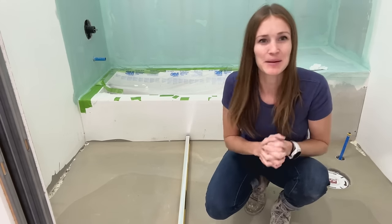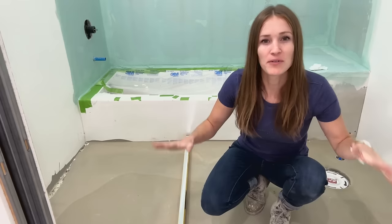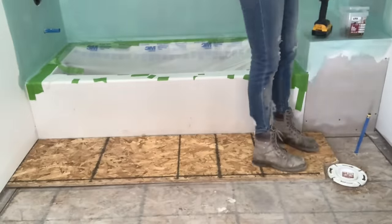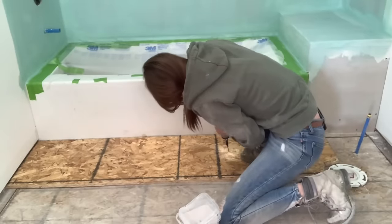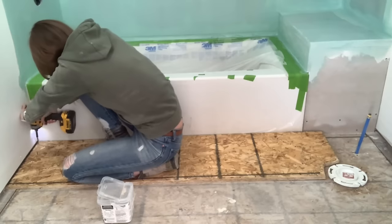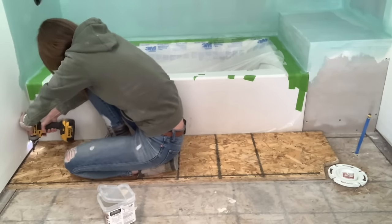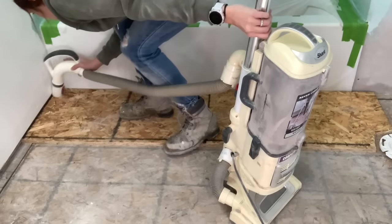Come with me and I'm going to show you how to smooth the floor before you lay your tile, LVP, or whatever you're going to put on top of it. I had a pretty big dip towards this side of the room. Because self-leveler is pretty expensive, I tried to make up the height that I could with a piece of OSB before I started the self-leveling process.